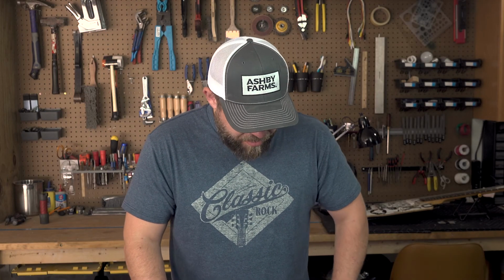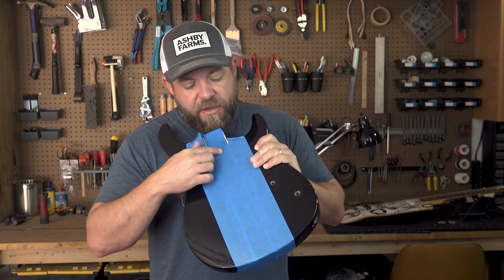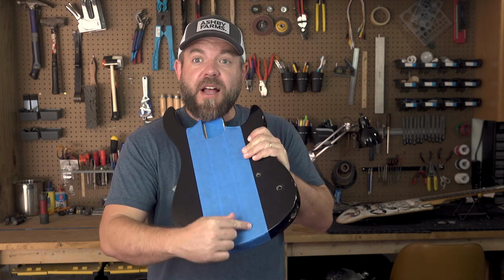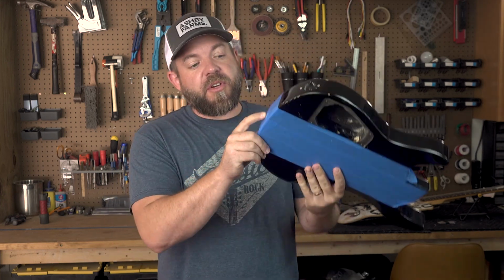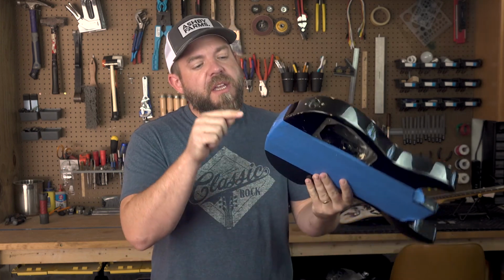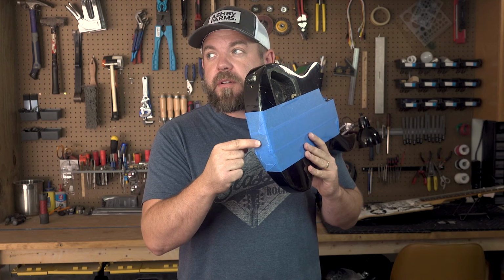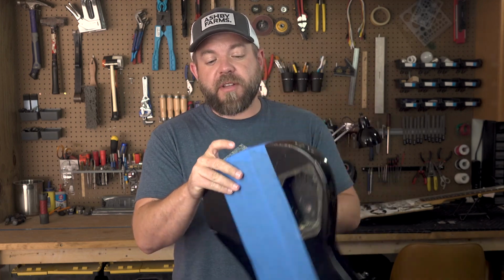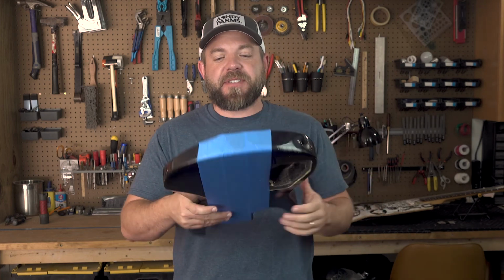I guess I should throw in here quickly, I didn't mention it, but the most important thing I'm doing in this layout is making sure that you get a good solid center line. And an error that some people make, or could make, I say this because I've done it, is thinking that the hole for your end pin is centered. Not necessarily, so don't reference off of that.